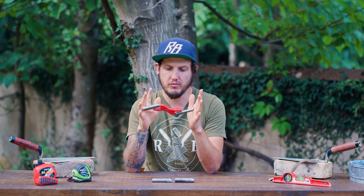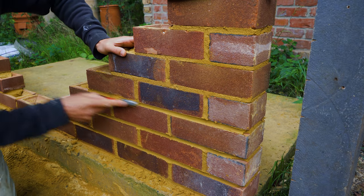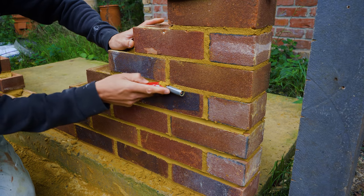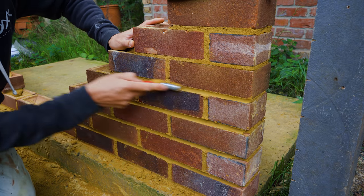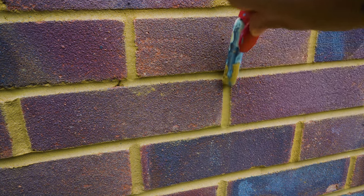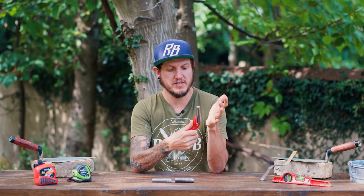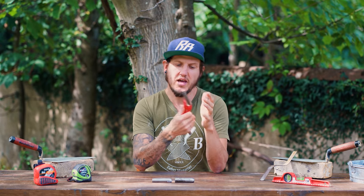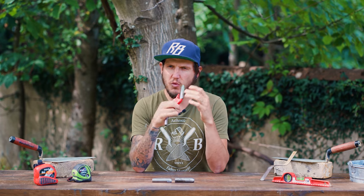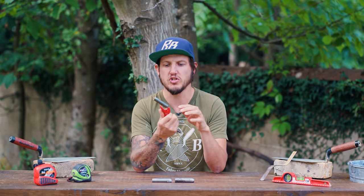A little pouch would have gone far with this, in my opinion. When it comes to the actual jointing itself, I find this joints up extremely smoothly and comes up very nicely. I find that the topping and tailing using this is very easy. I like to use the top part of the jointer to do the topping and the base to do the tailing. It's not necessarily hindering my brickwork whatsoever — it's just a different feeling to using the tool.